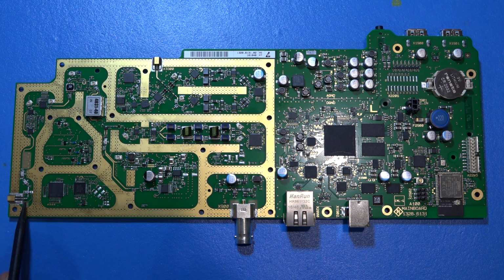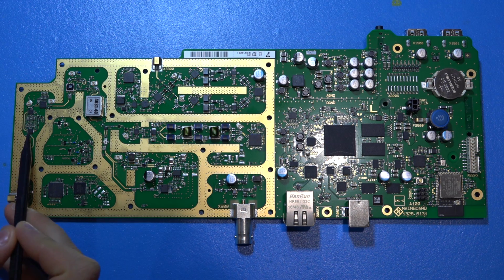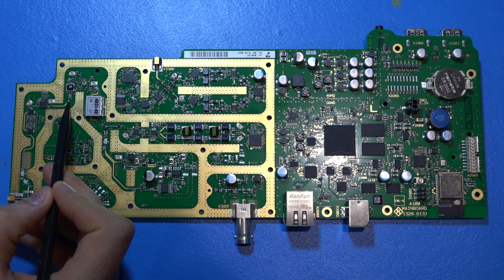Now this has all the components you would expect to find at the input of a spectrum analyzer. We have AC coupling, preamplifier section, low pass filtering, a programmable digital selectable attenuation section. In this case, we have a switch attenuator in the front, and a digital programmable attenuator which then follows it. Now the signal after that would have to go into frequency conversion.